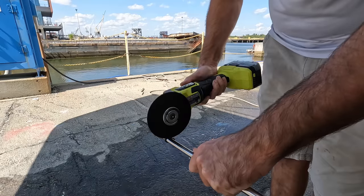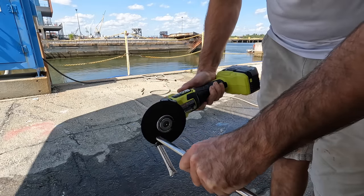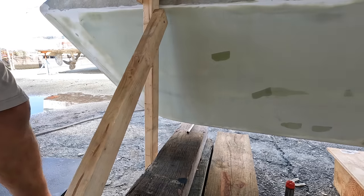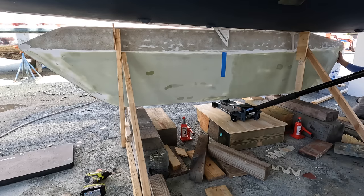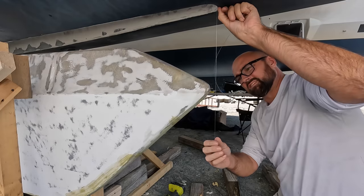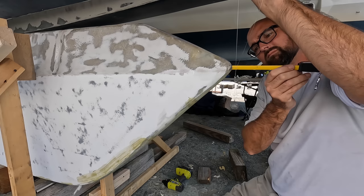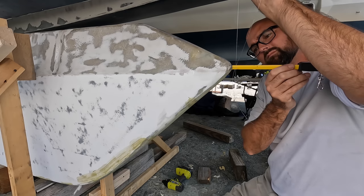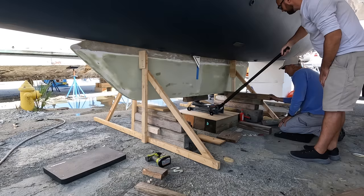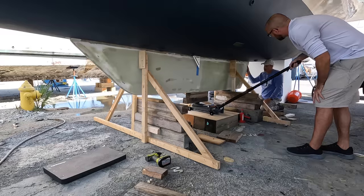How do you move something heavy and hard to handle in an accurate fashion? Well, the same way the Egyptians did. With the keel placed on top of the two pieces of stainless steel tubing, I grabbed a quick measurement as our starting reference, and then we carefully moved the keel exactly 1 centimeter forward. This worked out really well. We were finally able to do our first accurate and successful lift of the keel.